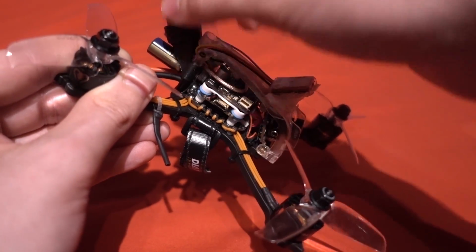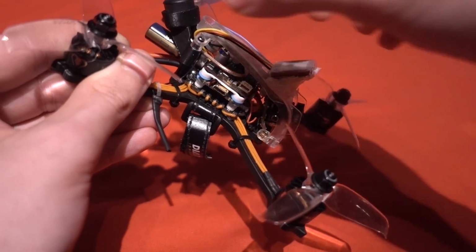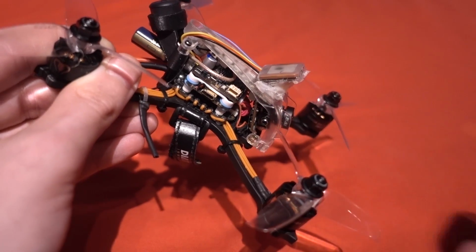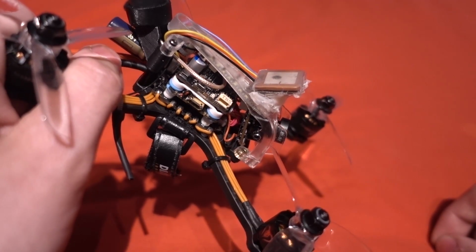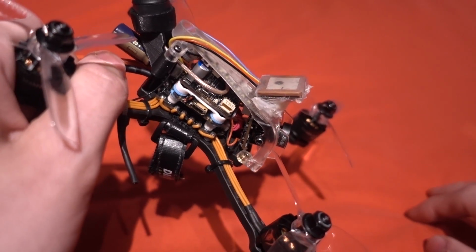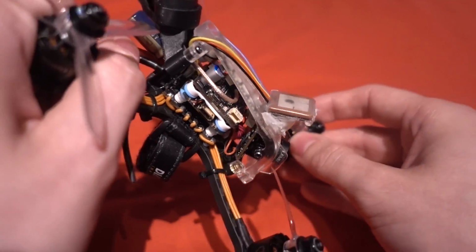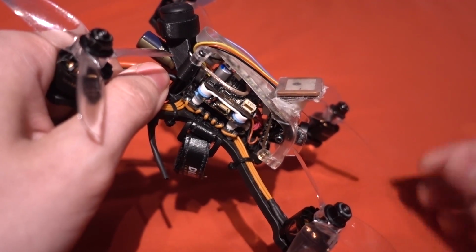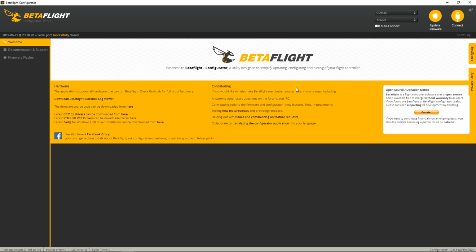Now, you could say, well, why don't you just extend the antenna? Well, we have the same problem, really. I guess it's not quite as bad, but extending the video antenna will still block the field of view of the GPS antenna. If you look at any of the car GPS systems, they always say to mount the antenna on a flat surface, and this is why I'm skeptical regarding what speed reading this thing is going to give, because I can't guarantee that it's flat, and I can't always guarantee that it's not going to drop satellites and give incorrect information.